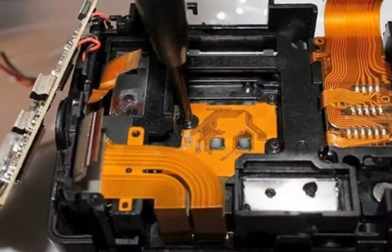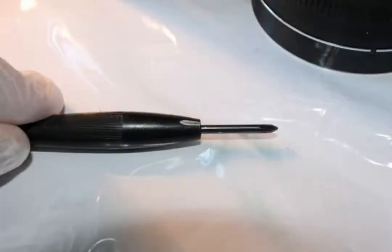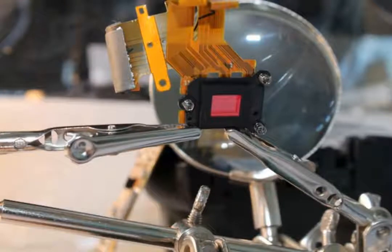For infrared conversion, I would also add 180 degrees to each number. When assembling, please tighten all screws and turn them a bit anti-clockwise according to your notes. Also turn extra degrees anti-clockwise for infrared conversions. For full spectrum conversions, leave the same degree numbers. If the camera does not focus, turn them clockwise slightly to shift the sensor to the front. Now take the sensor out, put the springs and screws into the bag, and cover the camera.